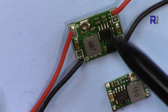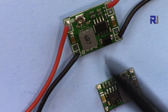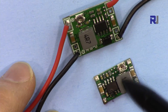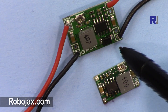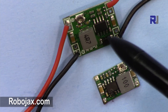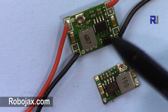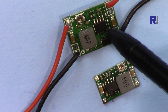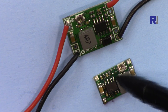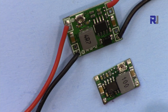After testing under different input/output voltages and currents, I conclude that both modules — though the larger one appears slightly better designed — can handle a continuous 1.5 amps. With air circulation, a cooling system, or a fan, they might handle 2 amps, but without cooling the internal protection shuts off within minutes. These are amazingly well-built compact modules useful for a variety of applications. Thank you for watching — please thumb up, share, and subscribe.